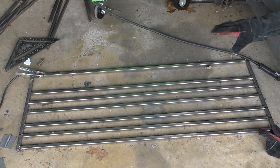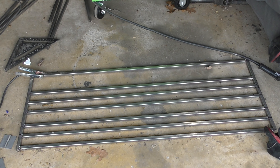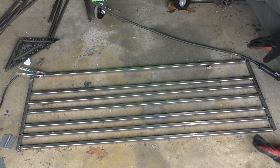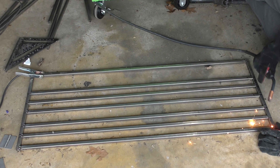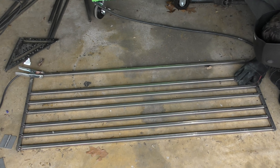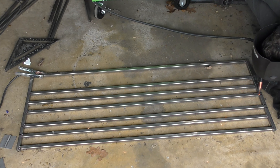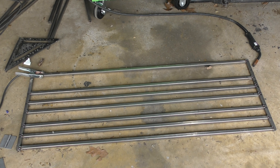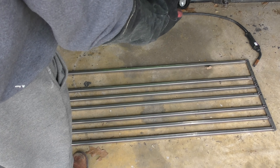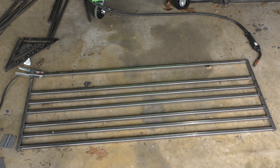A key thing here is once one of my sides are fully tacked in, I'm letting it move around and wiggle around. I know I cut these square and flush — that's all I'm going off, as well as my marks on the steel for the distance and spacing. When I get to a certain joint, I just give it a nice little nudge, tack it in place, and you're good to go. Now we have everything tacked in place. Everything looks nice and square — square enough for my old horse trailer. I'm going to flip it over, start doing full weld passes, and watch for any warpage.